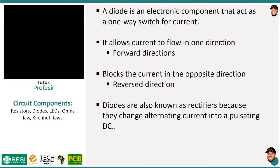All right, now, in the previous session, I mentioned that when your energy source is an AC, you have to convert it to a DC, and the process is called rectification. We mentioned that. Now, what I didn't mention was how to achieve this rectification, okay? The thing is that because diodes inherently have the ability to block current in one direction, by putting diodes together carefully in the way of an alternating voltage, you're able to restrict its movement and end up with a DC voltage. Now, I'm not going to go into details of that, but you can check that later, okay?